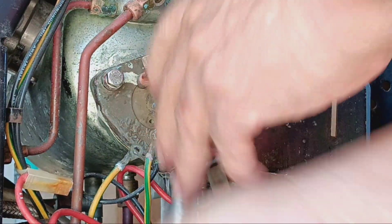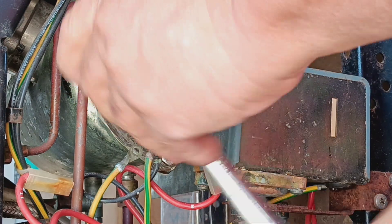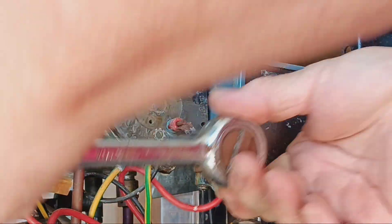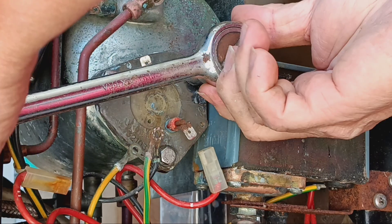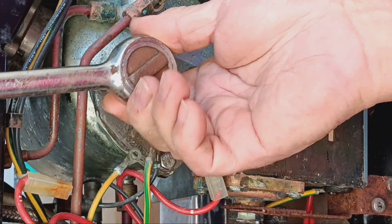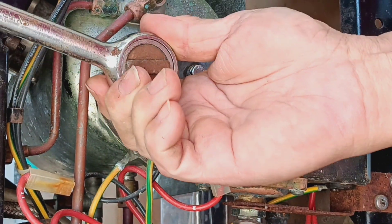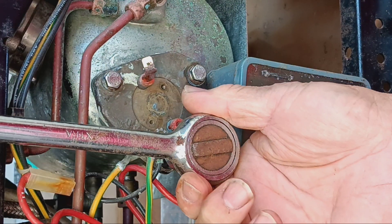This machine was fully tested in the last videos. Go all the way around the circumference turning each screw a quarter turn until it gets to about one-finger tight — same tightness all around — then keep going around making it a little tighter each pass. This takes the stress off both points and creates even stress on the plate and the gasket.